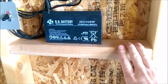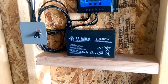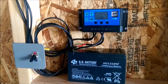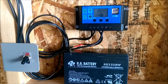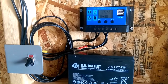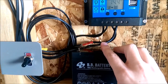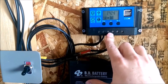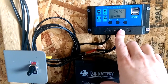I just installed this piece of wood here between the studs — I wanted it to hold everything up. So I got a 12-volt, 7-amp-hour battery, and this battery runs the LED lights. I just needed a way to charge this battery so it wouldn't die whenever I use the lights. You can see that I have the leads of the battery going into the battery terminals on this solar charge controller, and then the solar panel's coming in straight here. Super easy to get that hooked up.